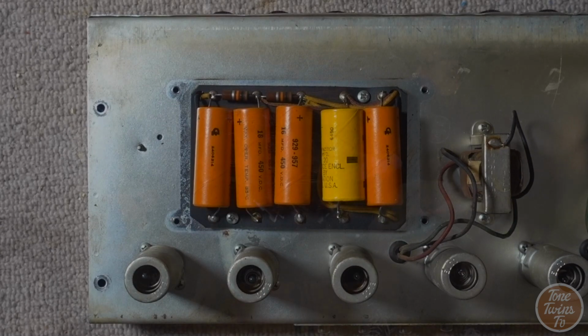The vibrato tremolo changed, so this one is a pure valve tremolo, but in the black panel ones they started using the opto resistor, a photosensitive resistor, so it's closer to the kind of thing they were using in amps like the Deluxe Reverb. So it's got a different feel and a different kind of characteristic to it. Absolutely. They messed with the negative feedback, so this amp has a lot less negative feedback compared to the later ones. And they also did some other interesting stuff, which is indicative of the fact that Fender were trying to feel their way through the design of this amplifier.